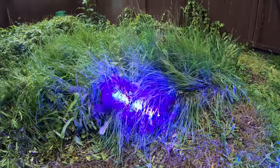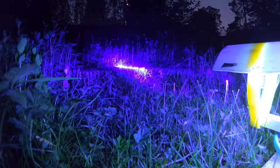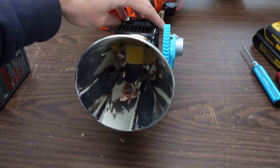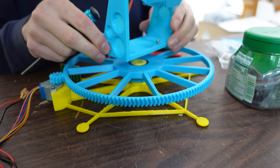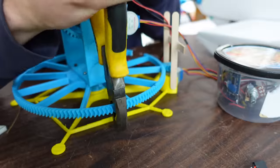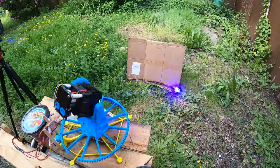So far all of these devices have been aimed at cutting the grass. But what if you don't want any grass at all and would rather just burn everything? For this, I designed a tilt axis. It would allow the laser to move in two axes instead of just one. I mounted it on the pan mechanism and attached the laser array module. Since adding an extra axis is clearly more dangerous, I clipped the gears so that it physically would not be able to rotate past a certain amount. I did this for both pan and tilt.